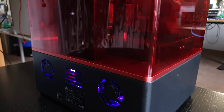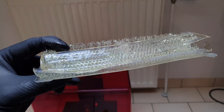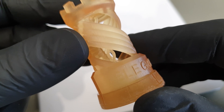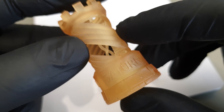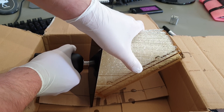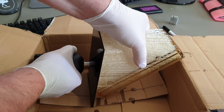Their mind-blowing two-second exposure time worked perfectly, but only for the small benchy on the side. Not sure precisely what caused the other fail, but their recommended 70 millimeter per minute lifting speed is pretty brutal. So far, for highest chances of success, I used to go with something as gentle as 10 millimeter per minute. I'm not sure why they call this a torture piece — in my opinion, small layer cross sections and no huge overhangs is guaranteed success. This was a torture piece: big geometric objects with different states of shrinkage in the same piece and separation forces hanging on that long, soft support material.